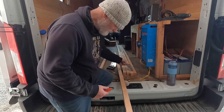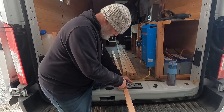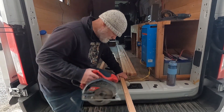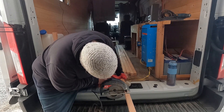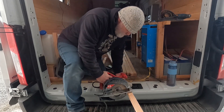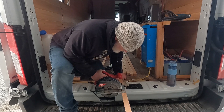I couldn't find a pencil or anything, so I'm using a razor knife just to notch the wood so I can get a mark I can see to start with. Then I put the square on there, line it up on my mark, and just cut — using a shallow line in the wood as our cut line. The problem I'm finding with this particular saw is the marks on the plate that are supposed to show you where the blade is going to be aren't entirely accurate.